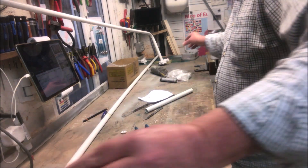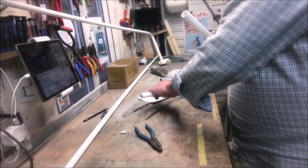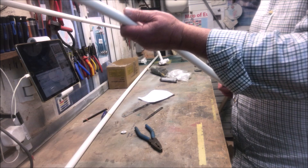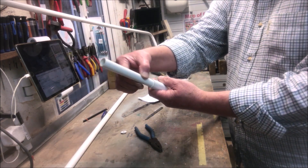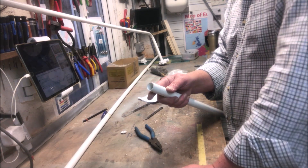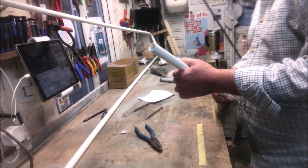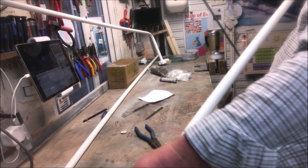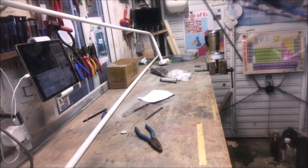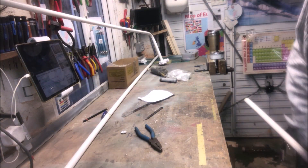Now when it comes to the two sides, everybody's going to want a different distance. So what you can do: you can make a slider. If you have a piece of 20mm and a piece of 25mm, the 20mm fits in rather nicely inside the 25mm, and that will give you an extender. On one of these ends you're going to have to put a 25mm box, not a 20mm. So the 20mm goes in there, the other side will be 20mm, and that will allow you, in theory, to slide to any size you want. So there's the Baron's topical tip on that one.